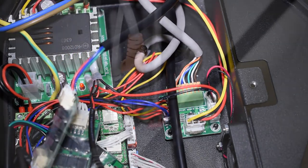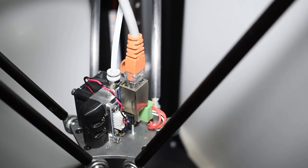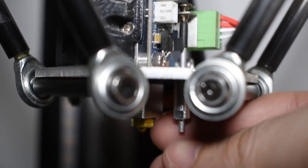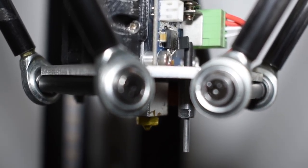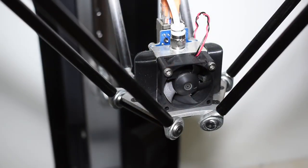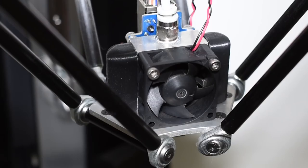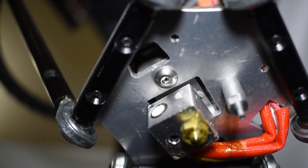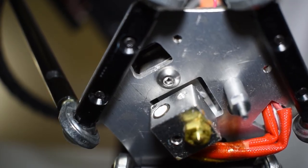The big cable goes down to the hotend and will power the fan, the heat element, the sensor probe, etc. On the hotend side, there is a small board to distribute the connections. The probe is not fully automatic, so we need to pull the probe down before starting the auto-level sequence. The sensing component is the hall effect sensor. One curious aspect is the hotend cooling — the fan pushes the air against the heat sink and then it comes out to the sides into the black printed parts, which then force the air to come out from the bottom and cool the filament.